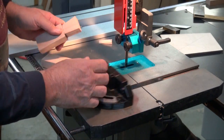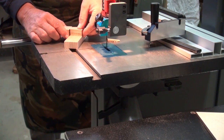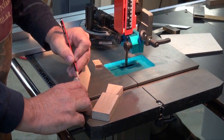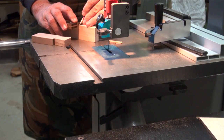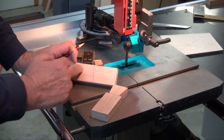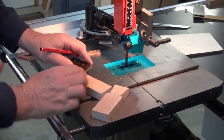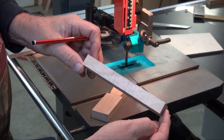Get the female part of the component. Place it on the edge like so, with the shoulders just up against this edge here. With a pencil, mark it in. I also carry these marks over to the top edge. And the bottom — the thinnest part of the dovetail — I move that line in about two millimetres or an eighth of an inch. Then I continue that line all the way through on both sides and also over the top. That will become apparent when we do the cut.